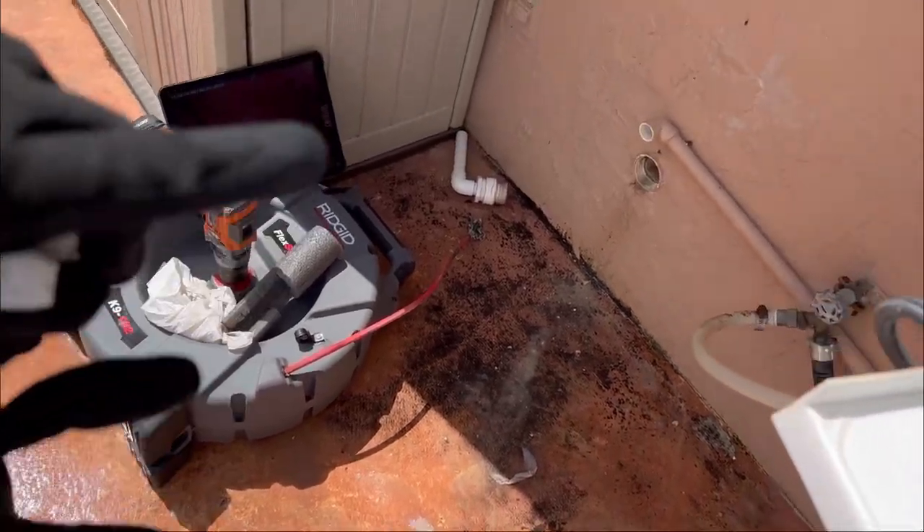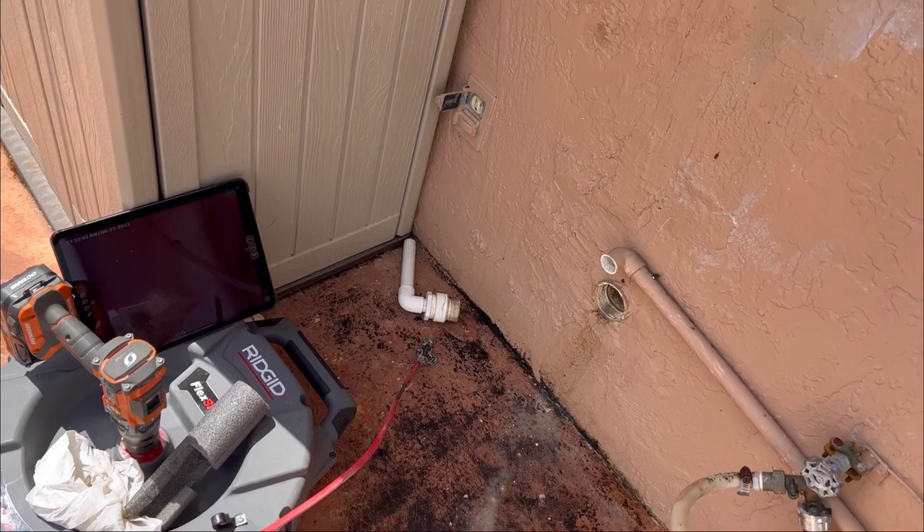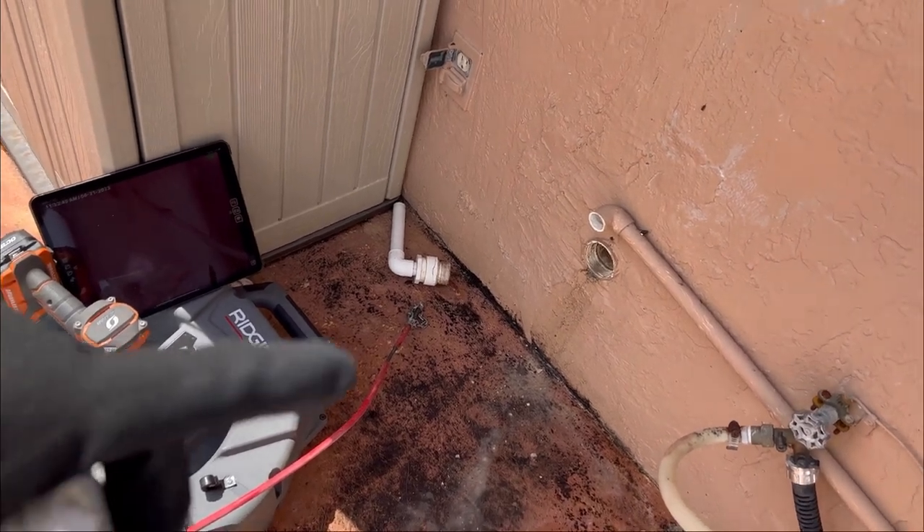With the camera we passed it and went all the way into the main sewer — about 70 feet, around 65 feet into the sewer. Now I've pulled the camera back out and I'm going to run the flex shaft in there again.